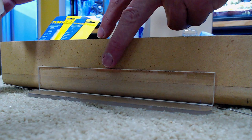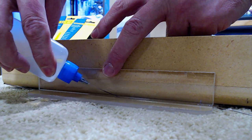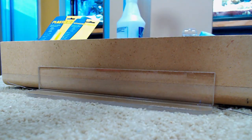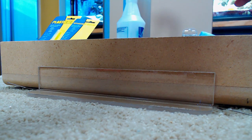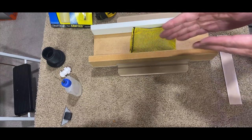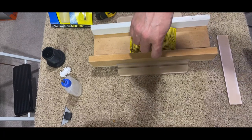I'm going to glue upside down so my fingers aren't in the way. I hold the piece steady, put the bottle in place, squeeze gently, and the seam is already way ahead of the bottle — it just reaches the other end and we're done. We leave that alone for about 30 seconds and make sure nothing is moving. I don't do anything to shake the table or touch the jig because I want this done right and looking good. If this were a taller piece I could put a clamp here; sometimes acrylic bows and you have to clamp it toward the jig to make it rigid and straight.